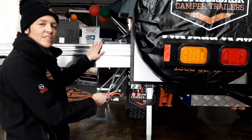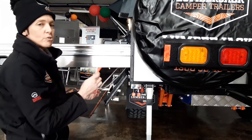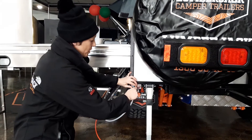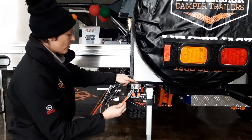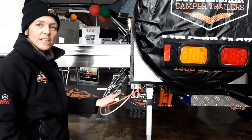We're here at the kitchen side of the trailer. Underneath the kitchen sink, tucked up here, are your two water lines — one is blue and one is red. You take the clear pipe and put it into the blue outlet, and the second one is the hot, so you put that into the red one. That's all you need to do here for now.